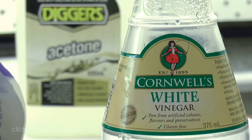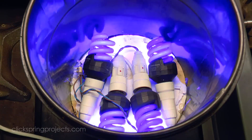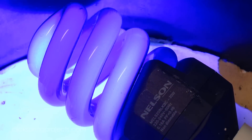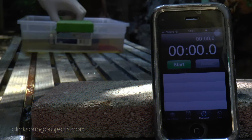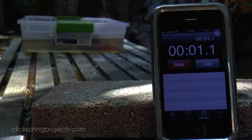But it's not without risk to the workpiece, and it requires a very precise and controlled approach to get the best outcome. So although I've covered the process in a previous video, in this episode I'd like to elaborate on a few of the key details that can bring about the best result. First of all it's essential to do some testing on scrap brass to find out the behaviour of your particular etching system.